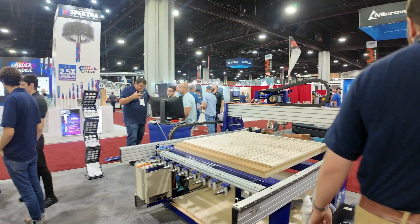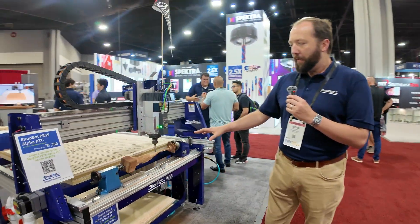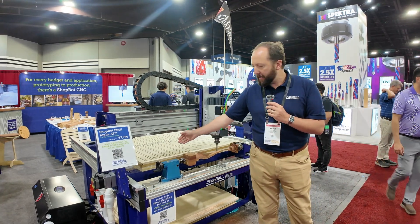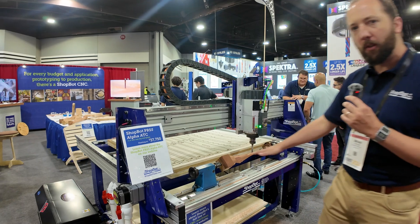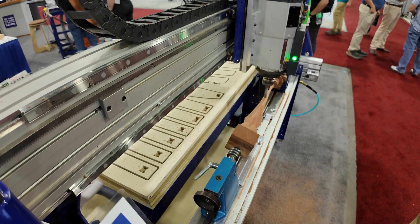On the front of the machine we have a 6-inch rotary indexer. We've found that it's a lot easier to load this indexer when it's on the front of the machine, nearer to the user. We've got about 6 inches in front of the cutting area, so you can still access the full table and do 4x4 cutting, but you can then move forward and access the rotary indexer.